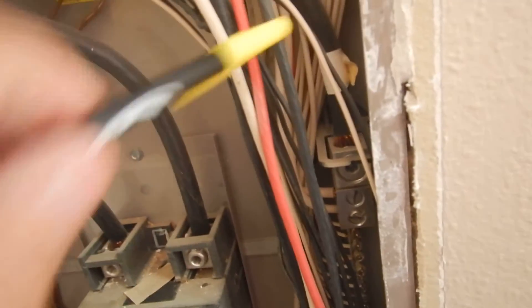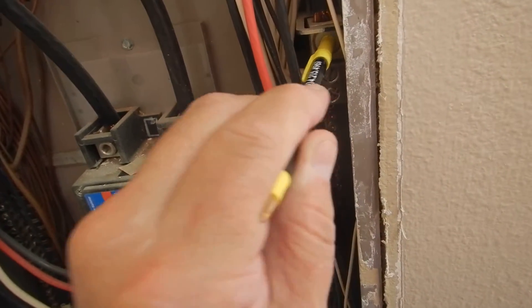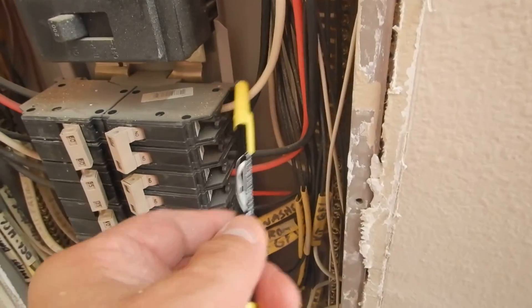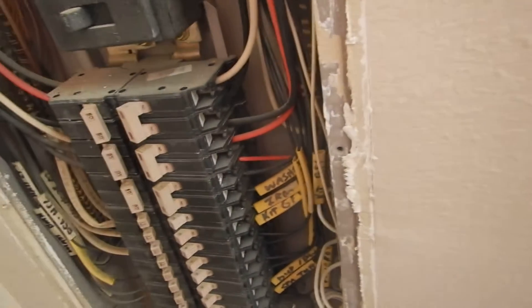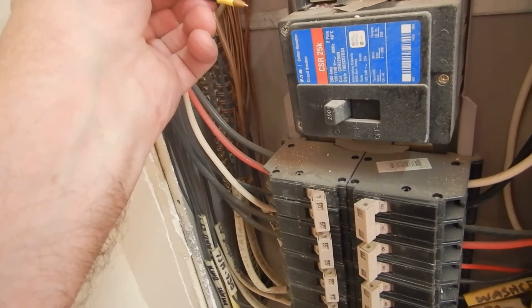It's supposed to be wrapped with thick tape — four times thick. If you don't know that's the main neutral going into the house, or that those are hot conductors, you don't belong in this cabinet. These white hots coming in must be wrapped with black tape, and the neutral must be wrapped with white tape. Cables are also not supposed to be in direct contact with the cabinet cover.